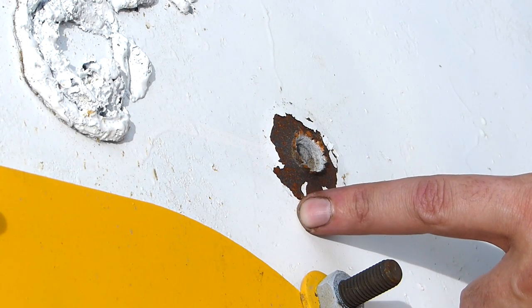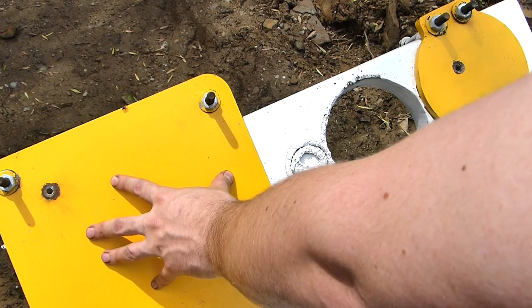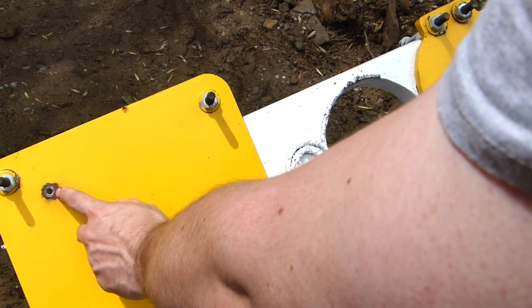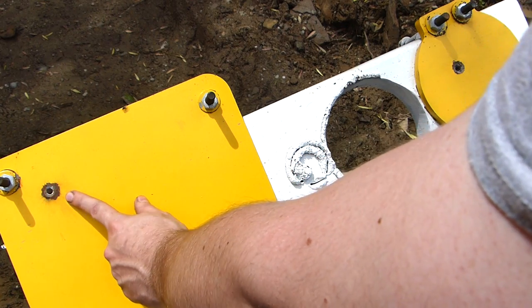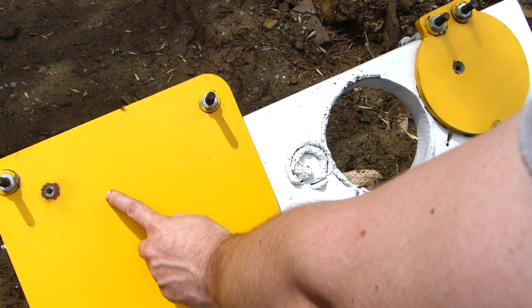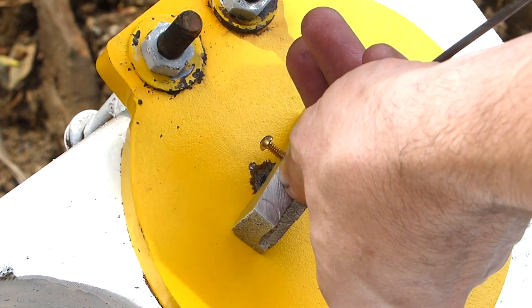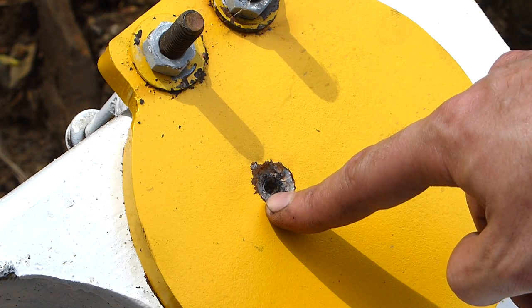Surprisingly, the depth on this hole is exactly 1 inch — it did not penetrate all the way through. On the AR500 plate, 3/8-inch, it penetrated right through no problem. Both the front and back surfaces are flat, not cratered up. I kind of wonder if there was a shattering action going on with the extreme hardness. Over here on our 1-inch AR500, we got 0.319 inches penetration depth on that hole.